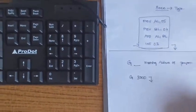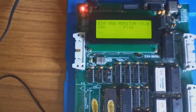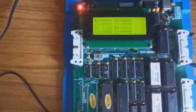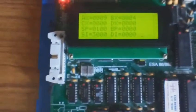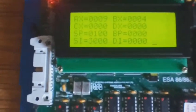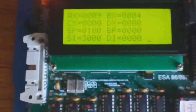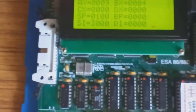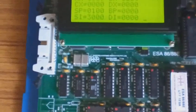After execution, all the contents of the registers are displayed on the kit. Since we wrote MOV AL,05 and MOV BL,04, adding AL and BL gives 9, and the result is stored in AL register. You can see the AL content displayed. This is how we use the G command to execute any program typed at a particular memory location.